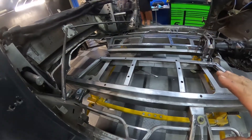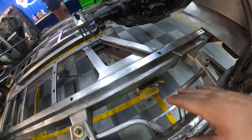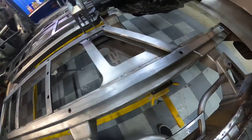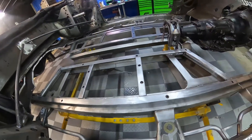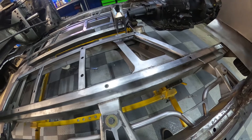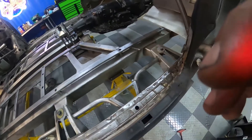Got the basic structure of the frame. I'm going to start tying it outwards — come from here to there, set it directly in place in the middle of the frame, and get some outriggers going. We're going to build this whole thing up to where it's an actual floor, make it all perfectly level so I can just drop my floor on it and call it a day. I measured 10 and three-quarters — we'll cut those up, sand them, and attach them.